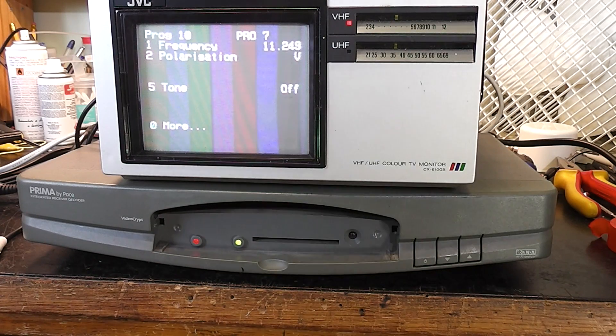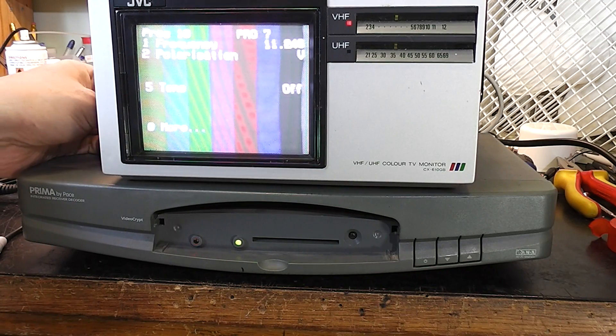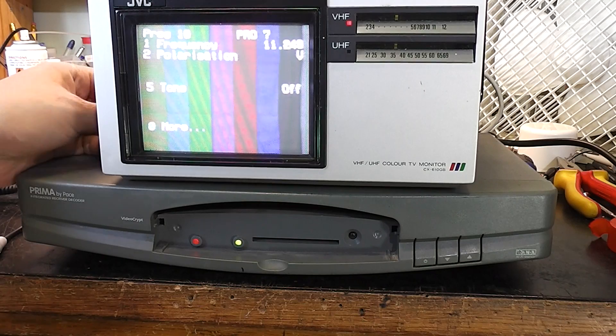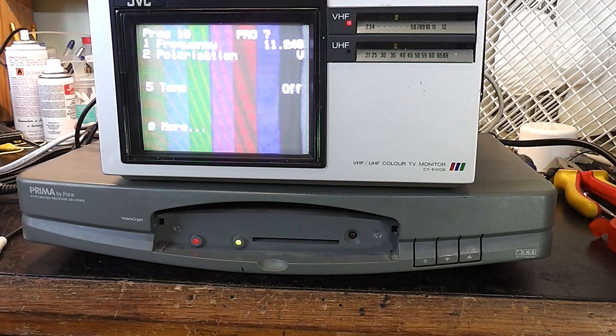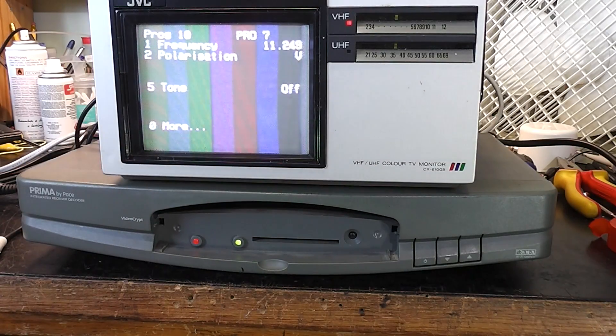I've put the other satellite receiver on — this one has had no modifications done to the video output, and you can see the colours look a little bit on the dim side. Notice that I'm able to lift it up with the contrast and brightness controls — that's not too bad, so in many ways you could probably get away without having to use a video amplifier. There's also a digital receiver here — if the receiver is set for a 10 gigahertz local oscillator in its menu, which was standard before dual-band LNBs, you'll notice the frequency reads 1249, which is spot on within the amateur television band. So you can get a useful frequency readout there, but the LNB setting needs to be set at 10 gigahertz.